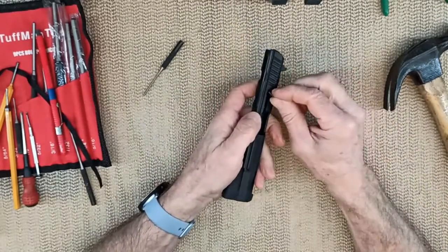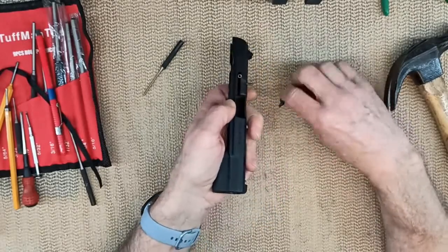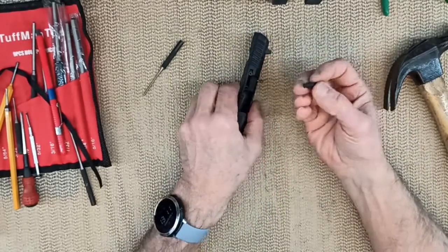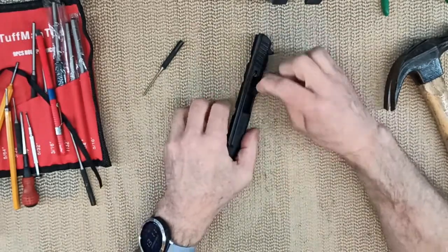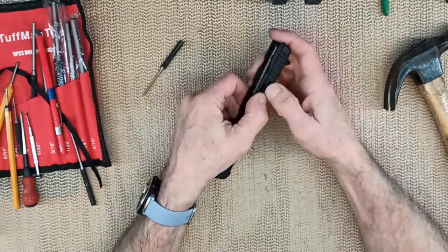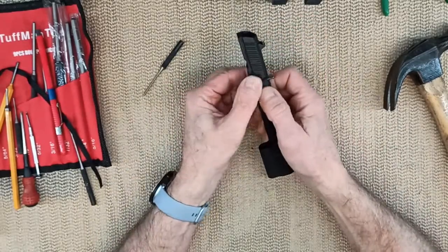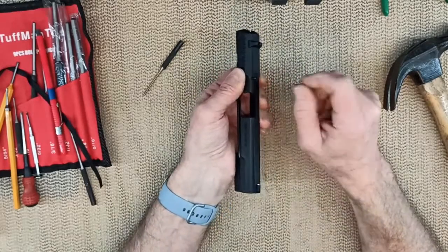So you need to put back the spring. There is a hole in there that will fit the spring. There is the ejector. Now, this part here is pretty thick, so you cannot really push it. You have to insert it that way and put pressure on the spring. You are going to have to put pressure on the spring, pressure on the front, and drive that pin.